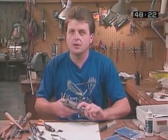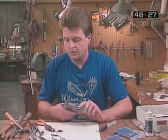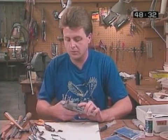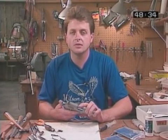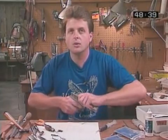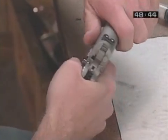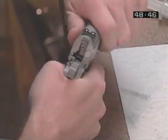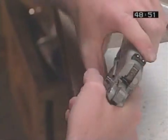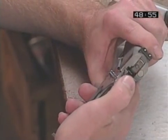Now once you know that your 80 series parts work like they should, that your hammer's not bumping the sear, and that you've got plenty of take-up in it where it goes into the half cock notch like it should, then you can snap it a few times, dry fire, and see how good or bad your trigger feels at that point. You usually always want to cycle it with the slide. It'll feel different if you just thumb cock it with your hand.